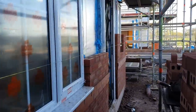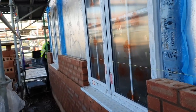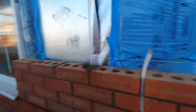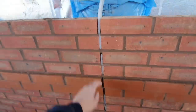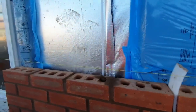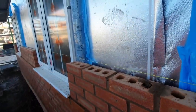I've got four courses to finish on one, two, three, four — four piers, or whatever you want to call them, just between the middles of the windows. And then I'm going to get my centre round, another course, and then it's a tie. A tie here. This has got a tie in every six because I've got ties either side. Tie there, tie up the reveals, and then I'm good.